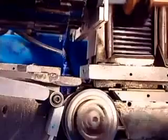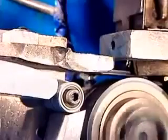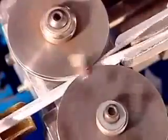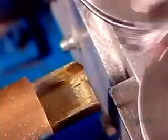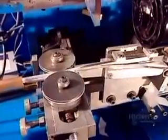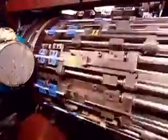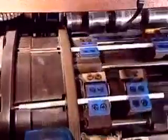Just like the forks, these straws will also be individually wrapped, but in paper, not plastic film. The wrapper machine feeds them one by one into a paper sleeve. Gears mesh the edges together, creating a crimped seal. The dies on this machine turn ordinary straws into flexible ones by forming a corrugated section that lets you bend the top of the straw toward your mouth. The machine compresses the corrugation to preserve the shape.